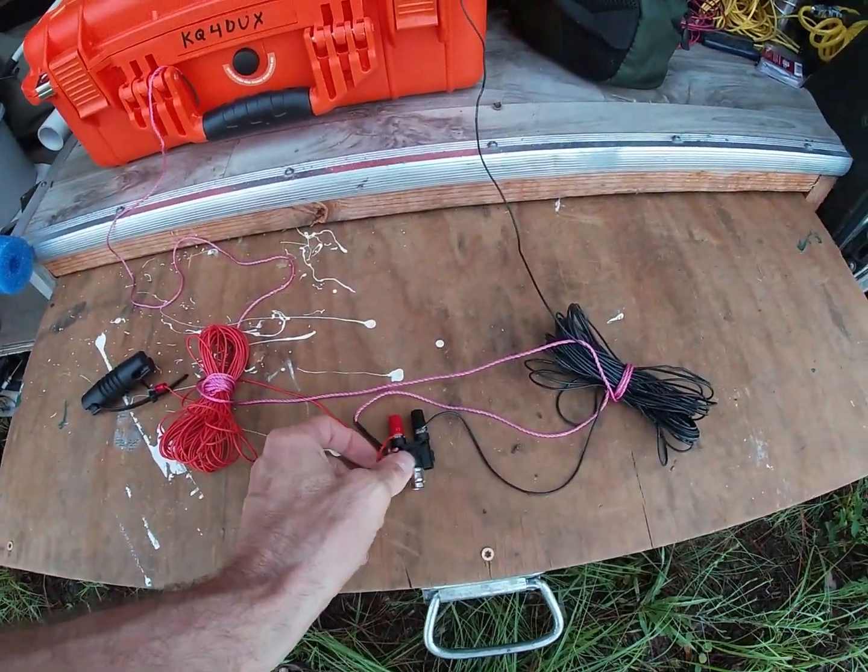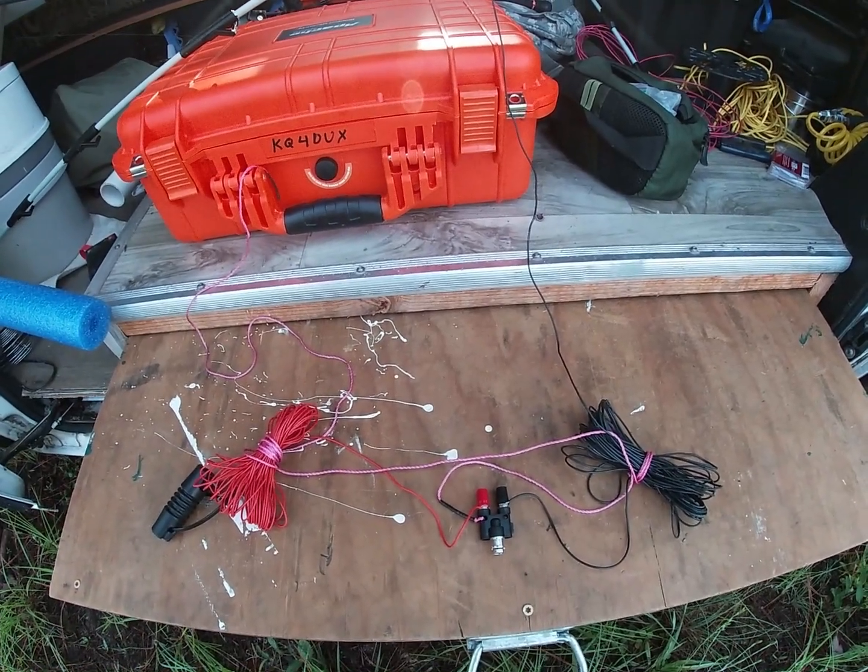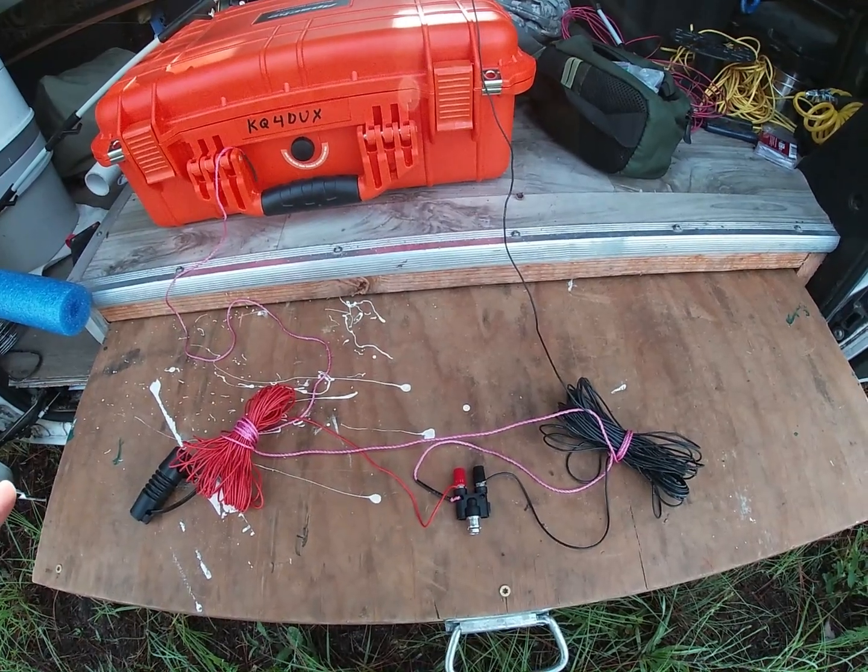This uses a banana jack or banana adapter and just some wire. You're going to need about a hundred feet if you're doing a vertical the way I'm doing it. For a simple dipole, you just need a little under 70 feet — each leg would be in the neighborhood of 33 feet. I started at 33 feet 4 inches and cut off right around 4 inches. This is insulated wire, which changes the length requirement compared to non-insulated wire. For the vertical, I'm running two wires to the coax braid side going 180 degrees apart, and one wire going straight up.